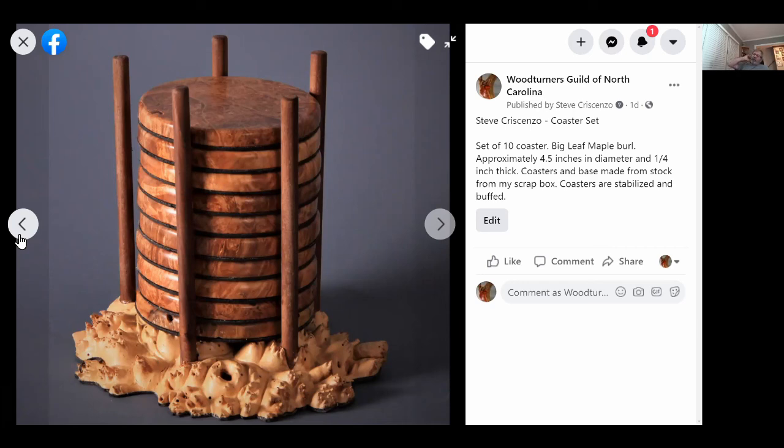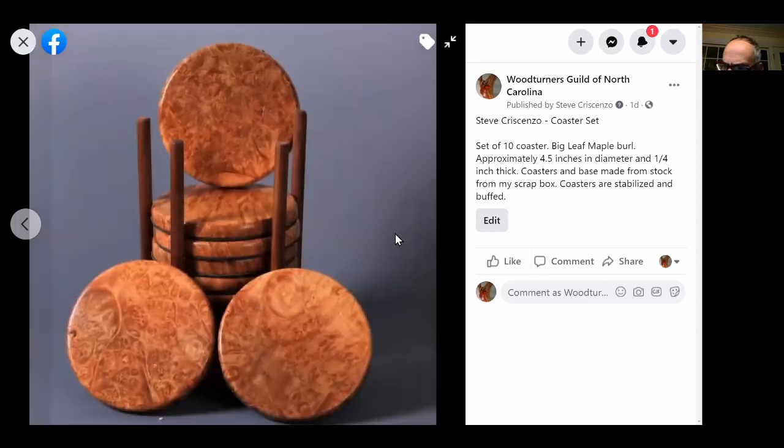But yeah, it was tricky. What I did on the drill press was put my template disc in there, put it on the drill press, drill a small pilot hole, and then use a brad point bit so it kind of centered on that. And they're just in there. The coasters are turned. Yep. And how did you hold them? I used my vacuum chuck. Oh.